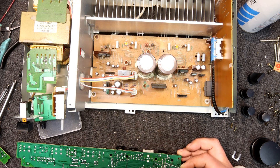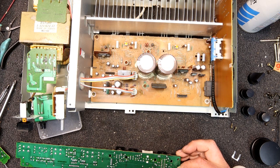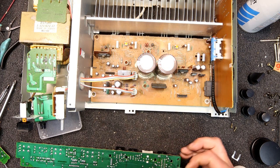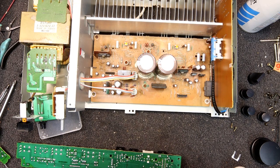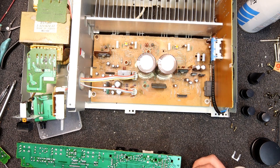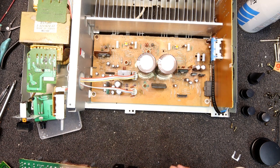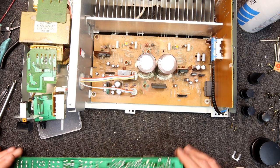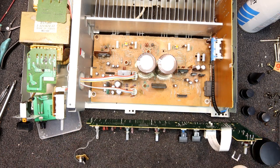While I'm here, these joints don't look 100% to me — probably just the way the solder is sitting. Doesn't seem to be shining — that joint definitely didn't look the best. There's something up with them but I think it's just the way they've done it in the factory, probably fine. Sometimes you look at these things and they don't look quite right. I think it's to do with the corrosion — the solder just lacks a bit of shine, and a couple of the joints don't look as well-domed as they should.